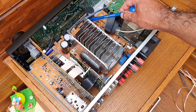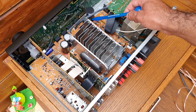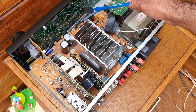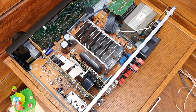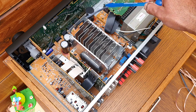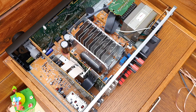And then you also have to put in parallel a big capacitor of the value of 3,300 microfarad minimum, or better 4,700 microfarads, to filter more. So all the noise, because alternating current has noise, it changes polarity 50 to 60 times every second, and that creates the noise. So you have to remove any residue which is passing through the bridge rectifier, and then the circuit goes further and feeds it.